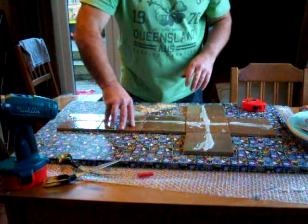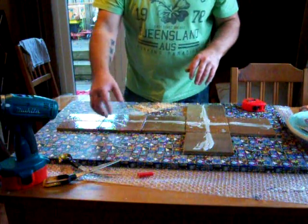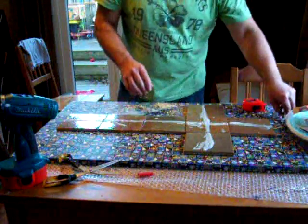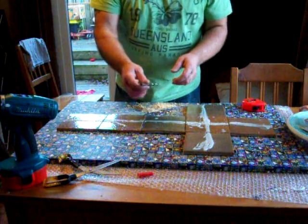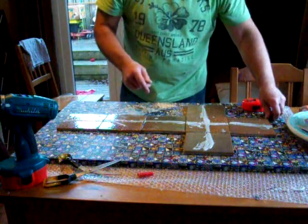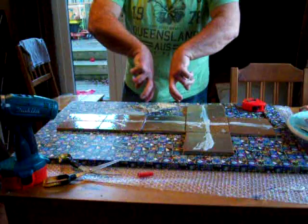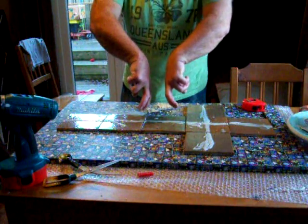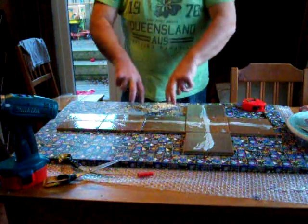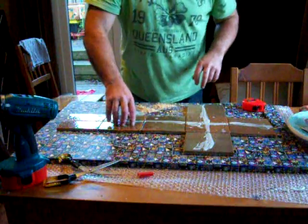Just to recap: five holes, six holes, however many you want to put in. The drill bit itself is about a half-inch drill — you need that so you can get plenty of glue in it and put the glue nozzle in it. Put a couple of them at an angle so that they key in when the glue goes off and they're not going to pull off. It's sort of hooking itself to the board.